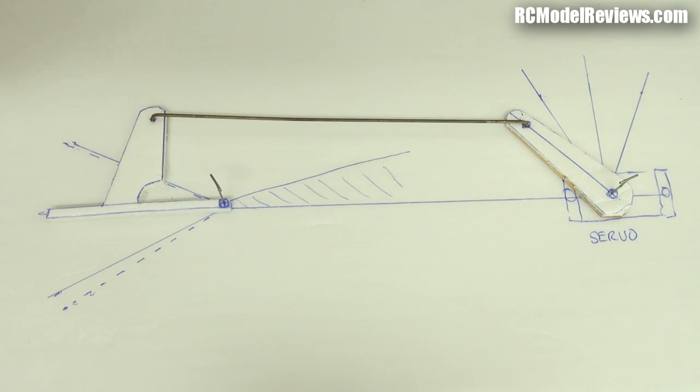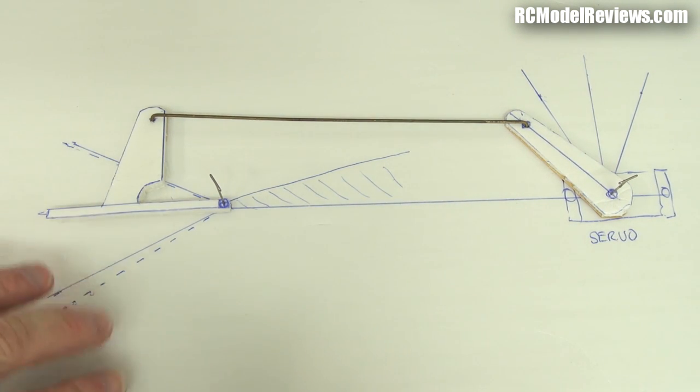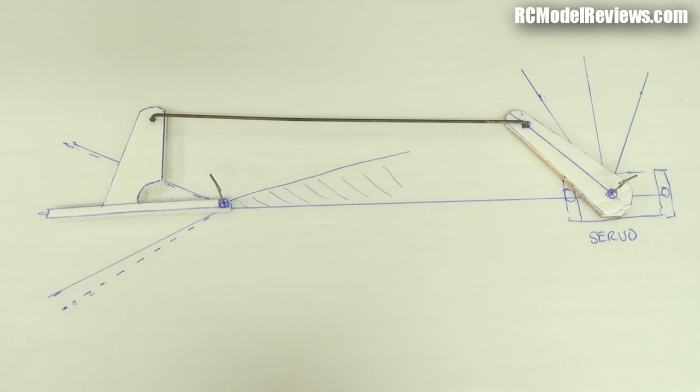That's why the basics of hinge geometry and control linkage geometry are so important. Thanks to Damper Workshops for providing this incredible test rig made from foam board. If you've got any questions or comments please ask them. It's important that we understand — when you're buying RTF, plug-and-fly, or ARF models from China — that they're not always designed properly, and sometimes you can improve them by making sure simple things like the control geometry are correct. Thanks for watching, bye for now.